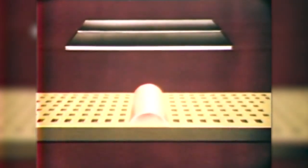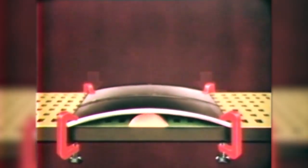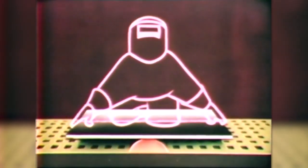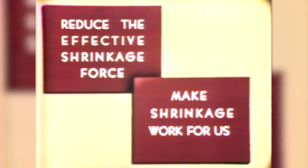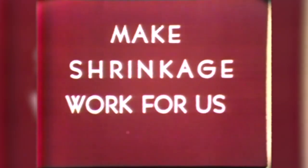We can also make shrinkage work for us by pre-bending or springing the parts involved. For example, when these two plates are sprung away from the weld side, the counterforce exerted by these clamps, holding the plates firmly, overcomes the shrinkage tendency of the weld metal, causing it to yield. But we can still use Mr. Shrink after the clamps are removed. Now, all he needs to do is give the plates a slight pull to remove any signs of distortion. Pre-bending may be applied to any number of welding operations; here it is being employed on these steam shovel dipper sticks to make sure that the parts will be straight after welding. So far, we have illustrated several methods by which we can control and prevent distortion: first, by reducing the effective shrinkage force, and second, by making shrinkage work for us.